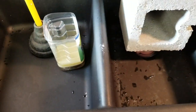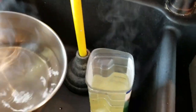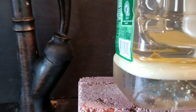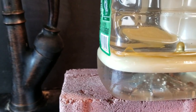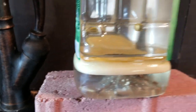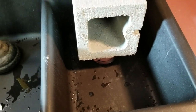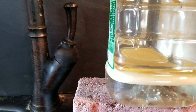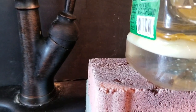But there's a secret to getting that grease to disappear — I'll show you what it is. We've got our little thing of boiling water. I've let it cool off a little bit, but we'll just pour it in and you can see immediately how it works. Melt that — you can see it gurgling down through there. The water and the grease will separate because they're different weights and different densities. But this is the whole secret to getting rid of your clog: you've got to get heat down there. That action is just melting that grease away, and it's the heat that's doing it.